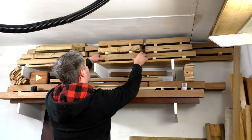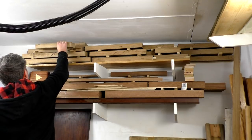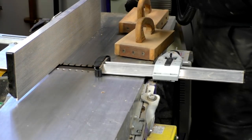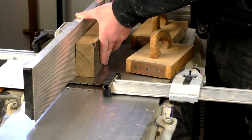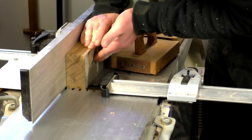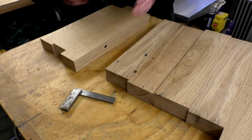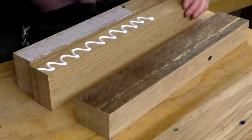For the head of the mallet I'd use some oak reclaimed from a local church refurbishment. This wood is around 100 years old and has some great character, and I could make use of some of the shorter lengths for the head. I started by planing one face of each piece flat and marked the planed face with an X so I wouldn't lose track. Then I worked on getting the edges of each piece square to the planed face — I checked the fence was square to the table with a small square, then squared up both edges. Next I chose which pieces I could laminate together to get enough width to form the head and glued and clamped them together with the planed faces face down onto the flat surface of my bench.